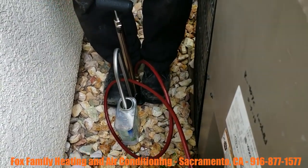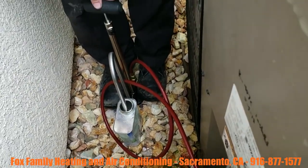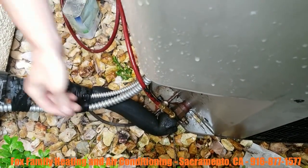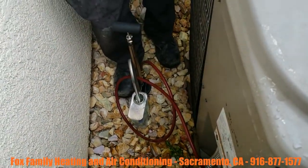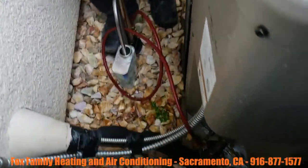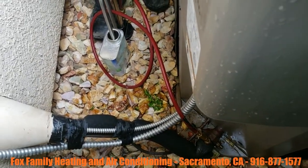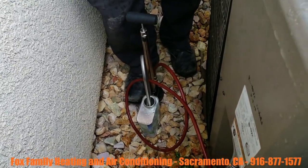There we go, that's about four — that's good enough. Now we can start this system up, and since we're putting it into the suction line the oil will go right into the compressor upon startup. Just wanted to show you how to add POE to the system — pretty simple, nothing too intimidating about it, just pumping it into the suction line. All right, let's get this thing fired up and see how it responds.